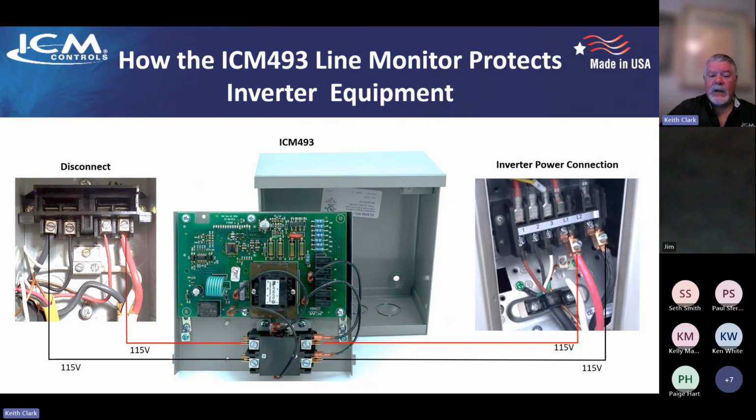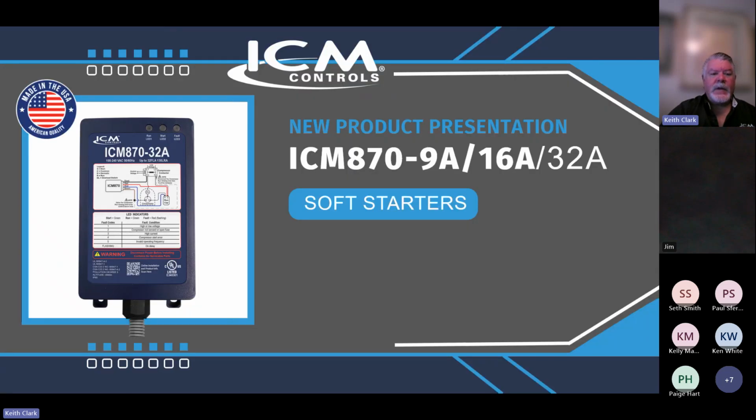That's for sure. So equipment manufacturers use a contactor, very robust. It's going to withstand the test of time. We use a contactor. There's other devices out there that use little block relays and stuff, and they're not meant to take punishment over a long time. They're a light duty switching device. We use tons of them on our furnace boards and things like that. So we're certainly very familiar with them, but that's the less robust way to go.